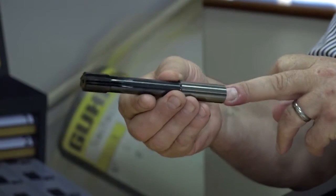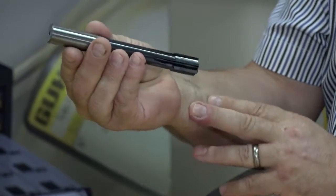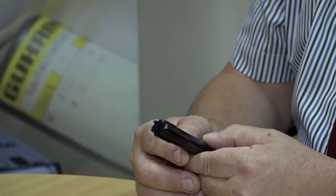When you're reaming, getting lubrication to the end of the rod, to the bottom of the hole, is essential. How do you get around this problem? It depends whether you are reaming a through or a blind hole. If you are reaming a blind hole, we have an axial hole that goes all the way through the back of the shank and comes out at the front — and you'll probably see from there it's a very large aperture.